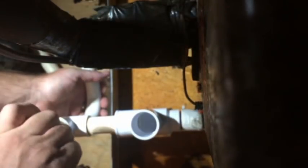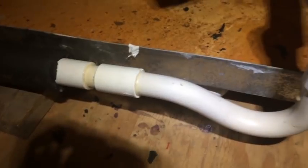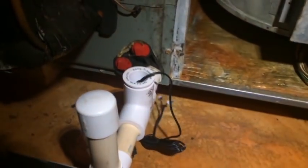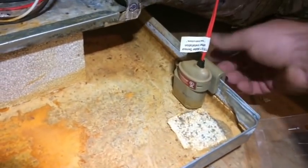I'm also going to replace the pan switch because they were concerned it didn't work — I'll be testing that in just a moment and you'll see it actually does work. Here's the finished product: a couple extra elbows, a couple extra couplings, and there's the actual float switch. It has two wires and just passes through the R signal or the Y signal, depending on what you want to do.